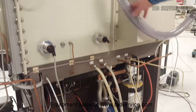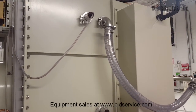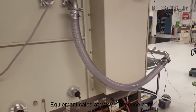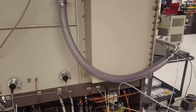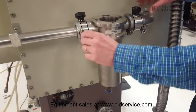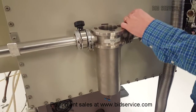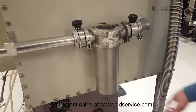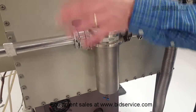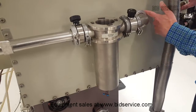Here's our cryo trap line that I talked about. We have the blower inside — it's blowing out through this line and to the side. We'll walk around the side here. Here's our cryo trap. You have valves on either side to open and close — they're both open right now. What you do here is you pour liquid nitrogen in. As the gas flows through this line, it comes from here across and back into the box.